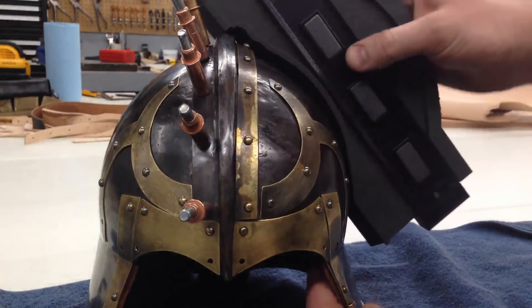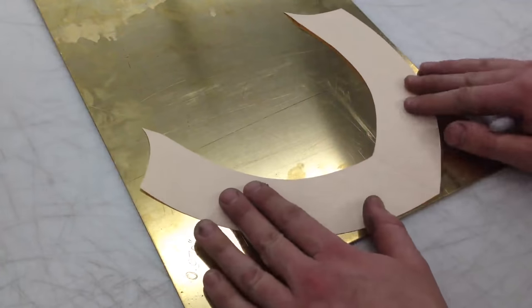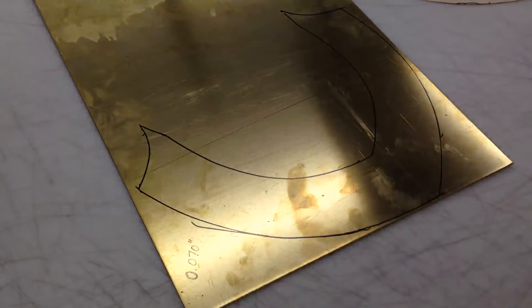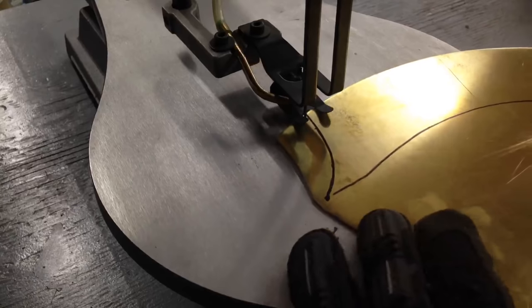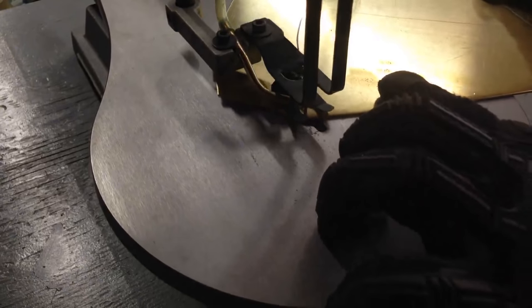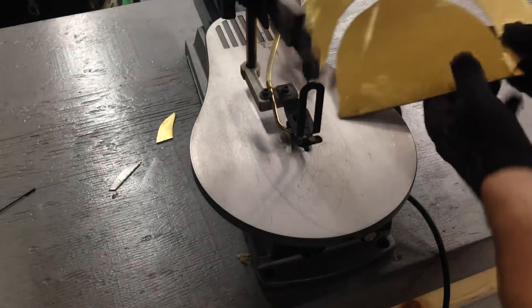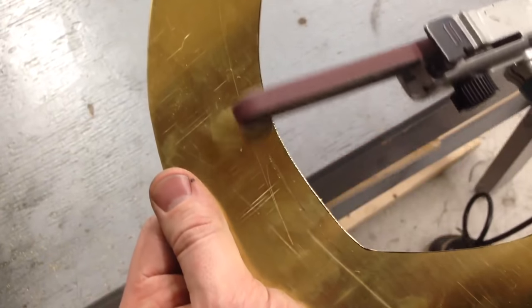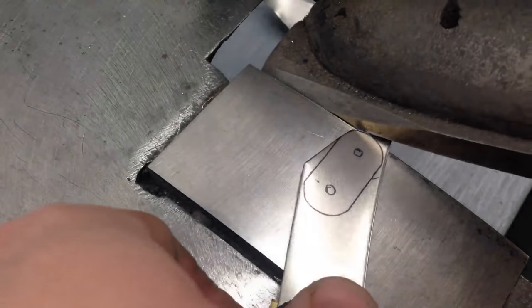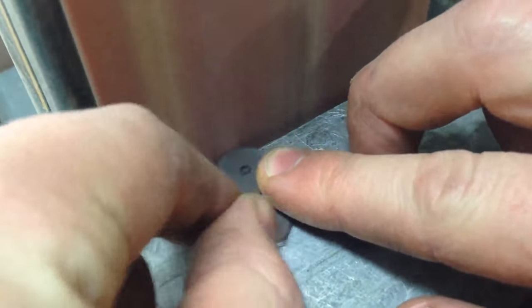Using a profile gauge I can quickly get the exact profile of the outside of the helm so that I can make the crest that goes across the helmet. Here I am with the finished crest pattern, putting it on a piece of brass that measures 070 of an inch thick. Now I'm heading over to the scroll saw — I use a blade specifically for cutting metal with a few extra teeth on it. You always want to match your blade to the thickness of the material you're cutting. I'm going to clean it up with one of my favourite tools in the shop, the power file. Now I have to make the little brackets that go onto the crest to hold it onto the helm.